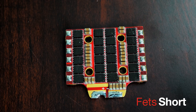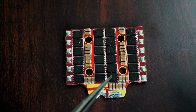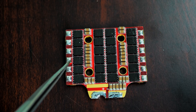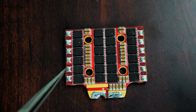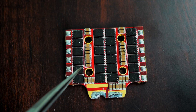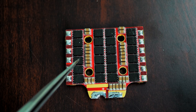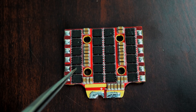The next thing we've seen fry ESCs: if you look at these ESCs, they have a bunch of FETs — these are MOSFETs. What these do is act like switches. Each ESC has three wires going to the motor, and it enables ground and power to two of those at any given time for your three-phase motor. If these get shorted, it will fry one of these MOSFETs. Sometimes you can see it's fried — it gets desoldered or there's a hole in it — and that's a clear indication some of the MOSFETs went bad. Sometimes they fry in a way where you can't see it.